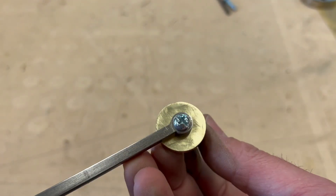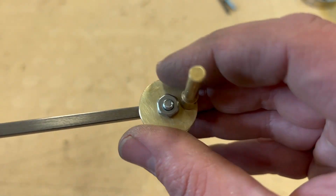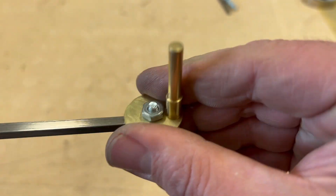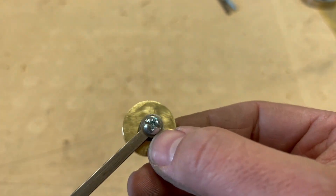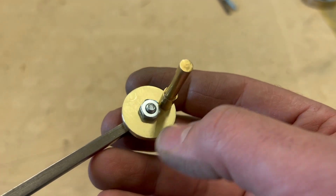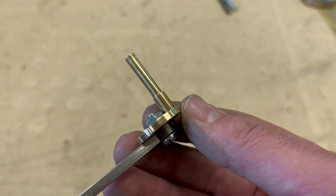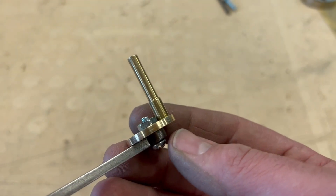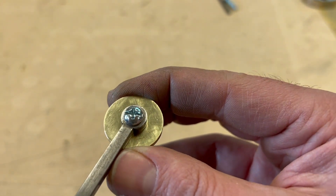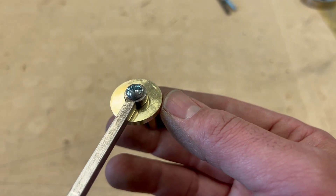Here's what I came up with. I made a disc and then actually just staked in the original pin. And then this lets us adjust this position relative to the crutch. Please forgive the completely inappropriate screw — that's what I had. And if my brain would have been operating on all cylinders, I would have actually tapped the screw into this disc rather than drilling it to size. But this is going to do the job, I believe. And at this stage, I'm going to just try to make the clock run and see what else we need to do to bring it into as good a condition as we can.